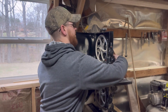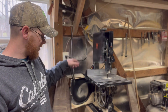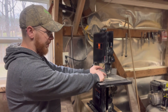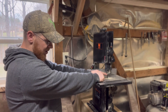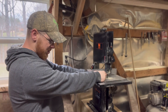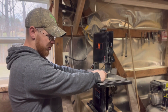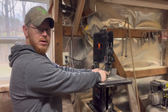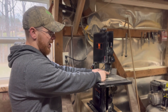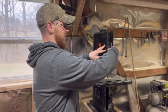The big wheel on top is for tensioning your blade. I have broken a blade before because of alignment. There's a bearing behind here that helps keep it flowing, and two little blocks with Allen screws you can tighten or loosen to adjust. I had them just way too tight, it got bound up, and snapped the blade right in two.